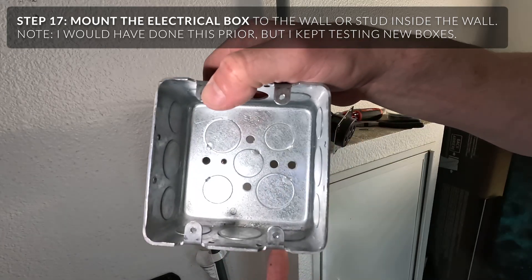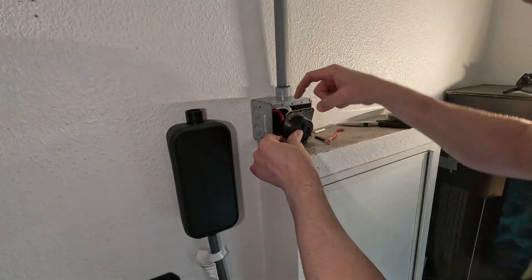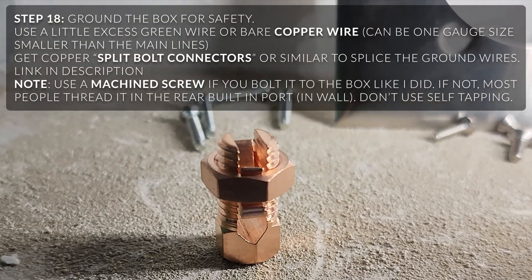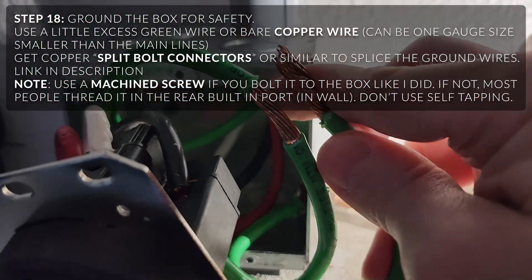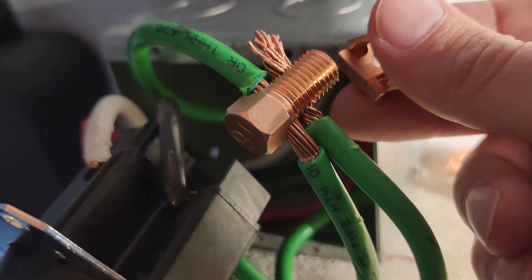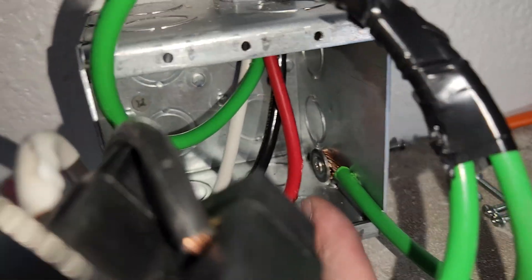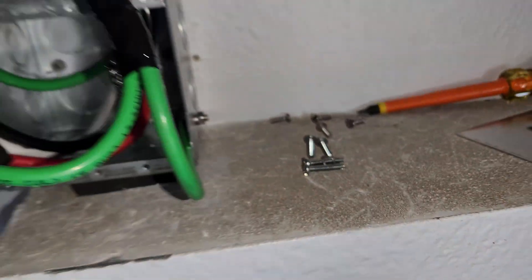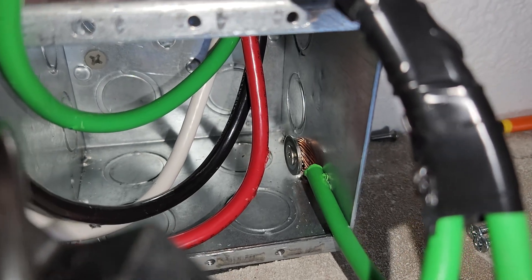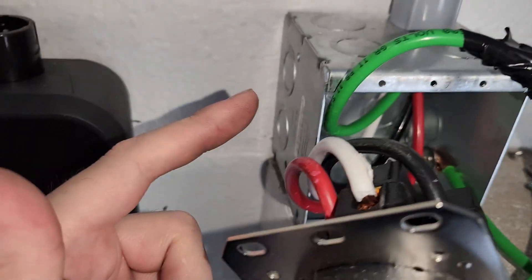These four were the holes for the Allen wrench. Just double-check the ports — red and black tucked in as best as possible. You're going to remove the nut, insert the wires, and make sure the bar is facing downwards on your nut. Notice how the ground wire is on the bottom. I put it on the bottom right of the box, with about 10 inches of wire tucked in, so if the power wire comes out while live and hits the box, it'll throw the breaker instead of electrifying the box. This is a good thing to do and I recommend doing it right off the bat.